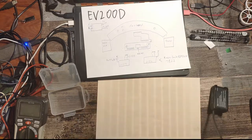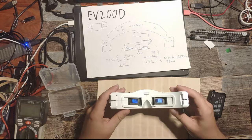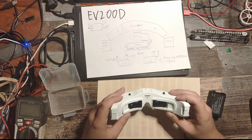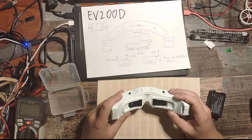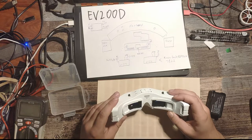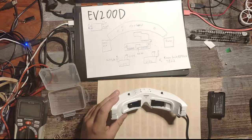Actually, if I look into it, both screens are working. But the left eyepiece is a little bit darker than the right eyepiece. I would think that's a problem with the backlighting. If it's a problem with the backlight, then we can actually check the circuits that make the voltage for the backlight, or the backlighting cable. If it were the BGA chip, I guess that's fixed.